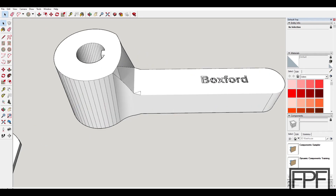I did put 'Boxford' on the wrench handle itself. Boxford pretty much just copied the design of the South Bend 9A lathes, and they offered both a nine-inch and a ten-inch version. The ten-inch is what I have, but other than the spindle height, I think everything else is pretty much the same. So this should fit the South Bend lathes as well — definitely the 9A, probably the ten-inch as well.